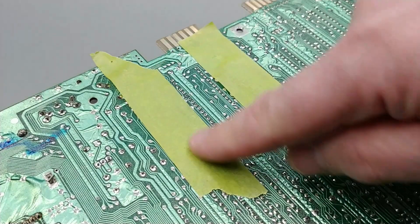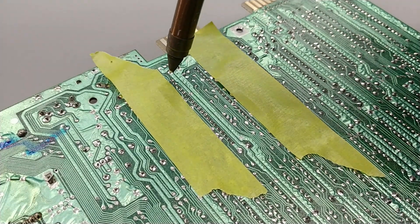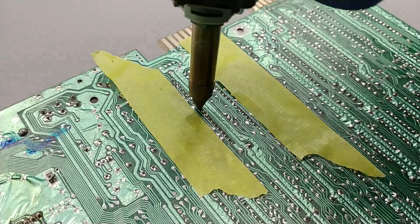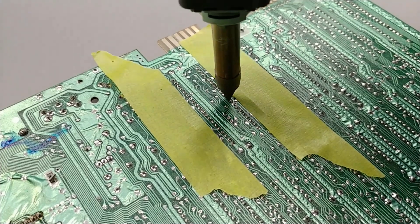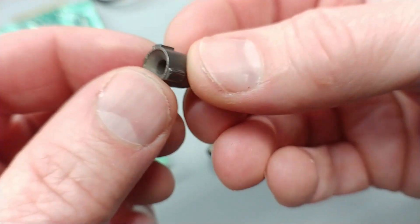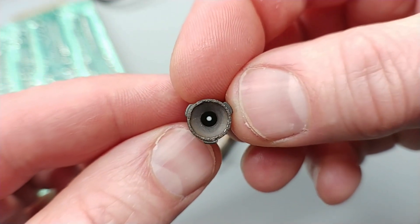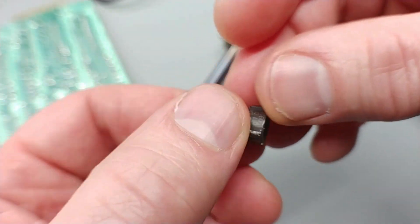Okay, it's desolder time. On the bottom, I put two strips of painter's tape on either side of the CPU socket because that's the first one I'm going to desolder, and I want to make sure I stay on course. I had to make a desoldering gun pit stop — it clogged. This is a one millimeter diameter nozzle. If you don't clean it out after every session using the little ramrod wire that comes with it, that little hole will clog up. In this case it was gummed up with old rosin and it took me an hour to clean it out. Pro tip: clean your tools.